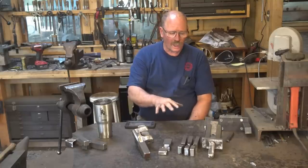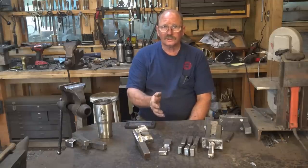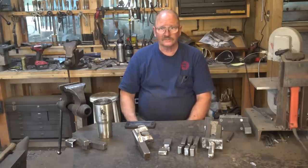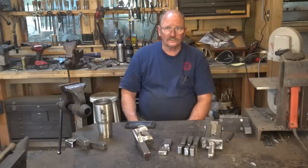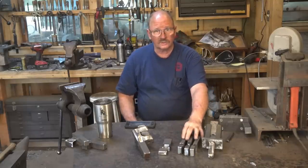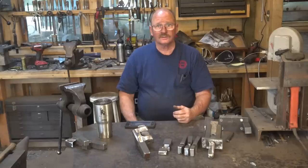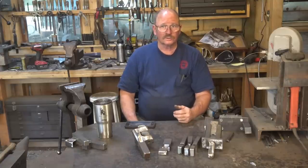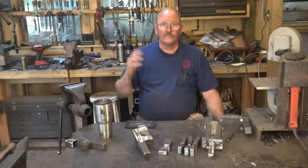The way you harden and temper your dies depends on the steel. These are 4140 — an oil hardening steel. S7 would make excellent dies — it's an air hardening steel. O1 would make good dies — also oil hardening. W1 wouldn't be bad, but it's pretty expensive in these sizes and harder to find. So I wouldn't use W1. But 4140, S7, and O1 are pretty good steel for making dies. If you can find 5160 in this size, that would probably also make excellent dies — also oil hardening. Read the books and the Heat Treaters Guide app on your phone for the specifics on how to harden those materials. If you're using mild steel, use super quench, or don't harden it and just plan on repairing your dies more often — no big deal either way.